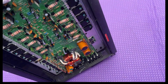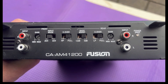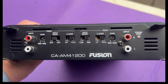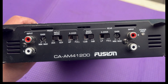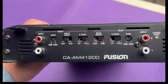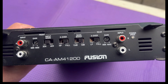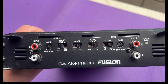On the other end, this is the input side. The controls are duplicated — one set for the front, one set for the rears. The inputs are RCAs, so you can't use a digital input with this old school amp — they would have been analog input signals, left and right inputs for your front and rears. Each set has a gain controller marked minimum and max, and then you've got some bass boost and crossovers. If you want to avoid those, you can turn the crossovers to full and your bass boost down to zero.